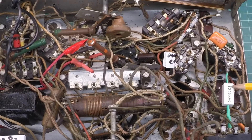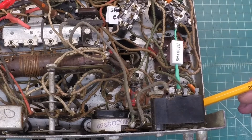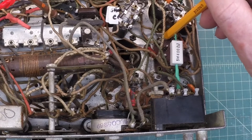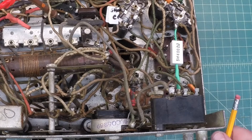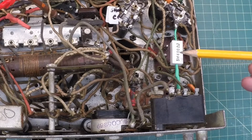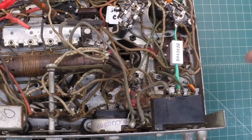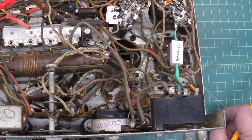Someone had worked in here on the radio. There was one of these old cloth power resistors in place — it came off the cathode of the 43 tube, but someone had tacked it into the plate of the 75 tube instead. It looked original, but after looking at the schematic I could tell it was tied into the wrong location. So here you can see I stuck a 5-watt 400-ohm resistor in to replace the old one. When that resistor heated up, I checked the DC resistance — when it was still hot, it went up over 1 meg. Just shows you how much these old resistors can vary.